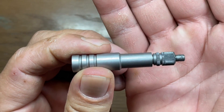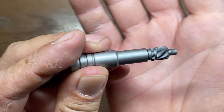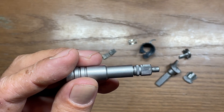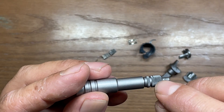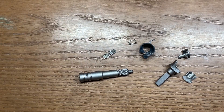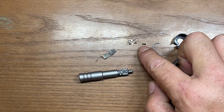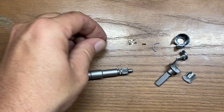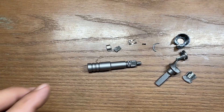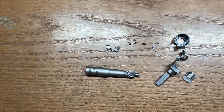Looking at the shaft itself, there is a little bit of a mark in one spot, but I think that's from when this thing destroyed and bent over — it wasn't the gearing that stripped. Normally if a ratchet mechanism strips out, you'd see a wide path of teeth that are bent over and folded. The keeper was fine, nothing happened to it, the little ball detent was fine, and the switch mechanism paddles on each side were all intact.